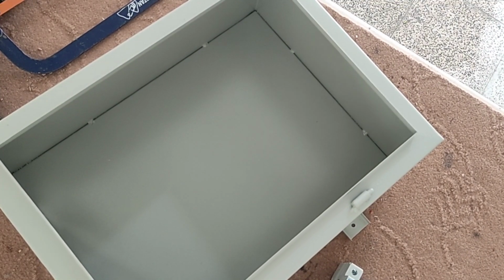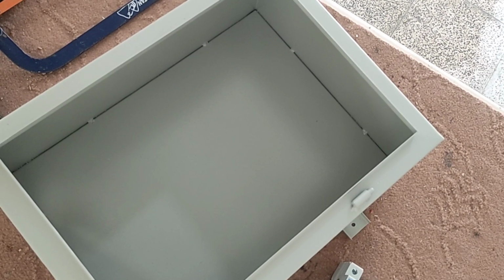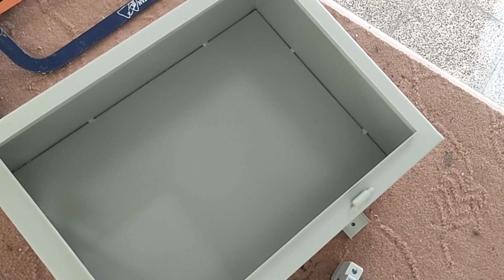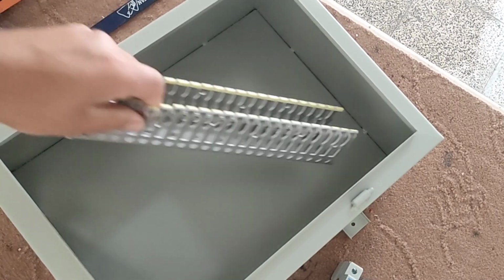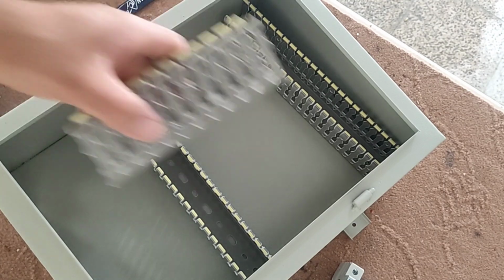In this video we want to wire an industrial distribution electrical panel. This electrical panel divides 3-phase electricity into 9 single-phase parts. Please be with me. The first step to assemble an industrial electrical panel is to install the ducts, which we do.